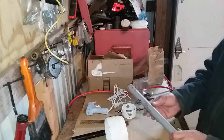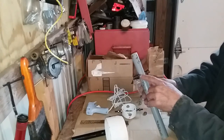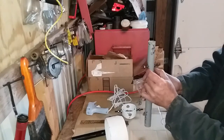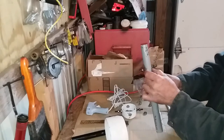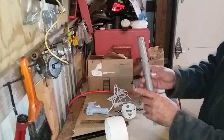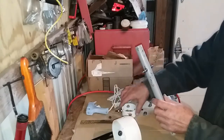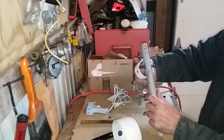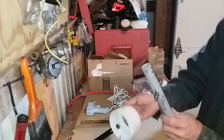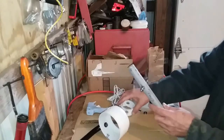Okay. Now I've got my piece of threaded material all the way through the center gimbal, two jam nuts tightened against it. I put a little pressure on them to hold them together, and you want to make sure this is centered. It's going to be easier for you. Because here, remember, when this is in this piece, you don't want these bolts to be able to hit these edges, see? Okay, so I'm letting you know that.